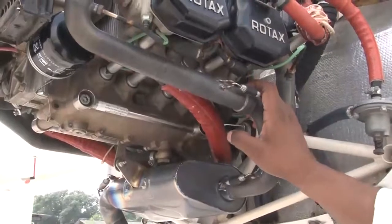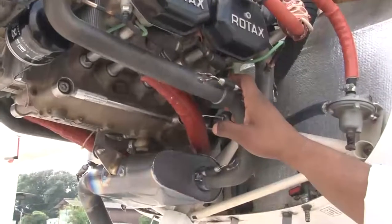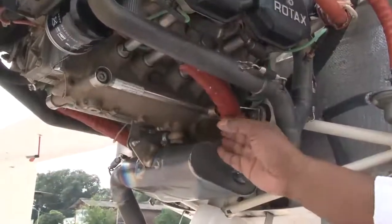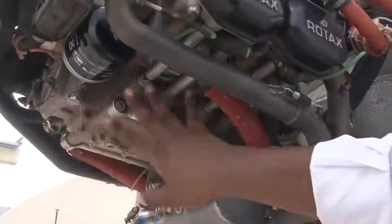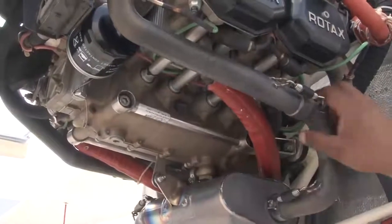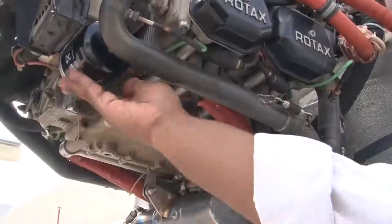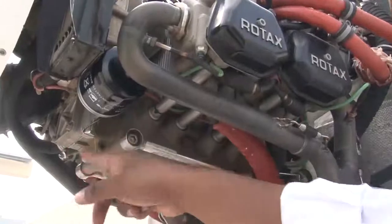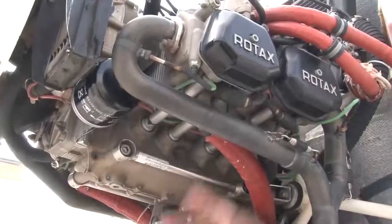Check for eventual fuel or oil leakage — there should be no spots on hoses, engine housing, or engine covers. Since the ground run has already been done, you can see there is no fuel leak, no oil leak here — the engine is completely dry. No oil leaks are observed. Now inspect for tight fit of the oil filter installed on the engine. This is the oil filter — there is no leak at the bottom of the oil filter. The oil filter is secured, properly wire-locked, and in place.